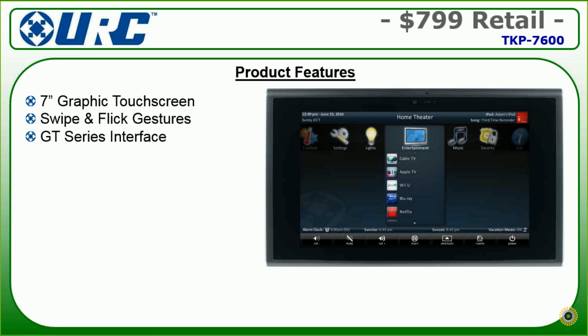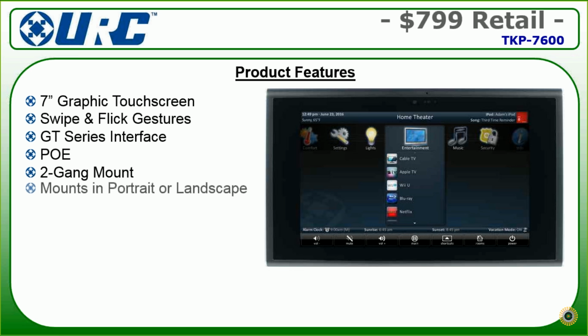It does utilize our GT interface, just like all of our other interfaces do. It's powered over Ethernet, but something a little bit new: it mounts in a double gang mount, and I will say the mounting system is way improved over the TKP 7000. It uses a magnetic type mounting system and is a lot easier to install, but it also gives you the ability to mount it in either portrait or landscape mode. This is very cool and will be very versatile in your installs.